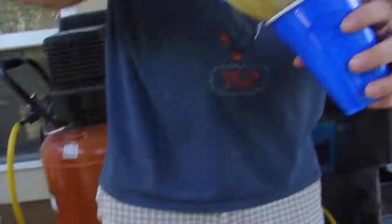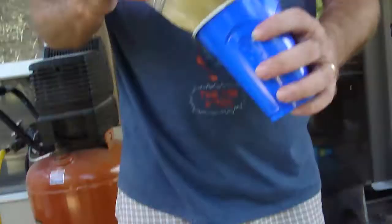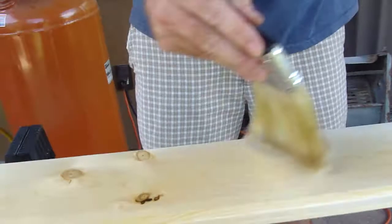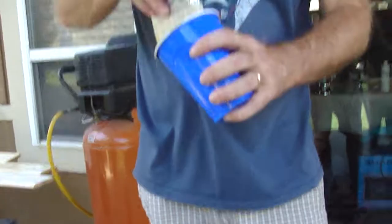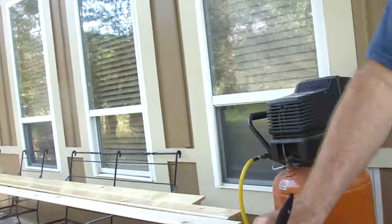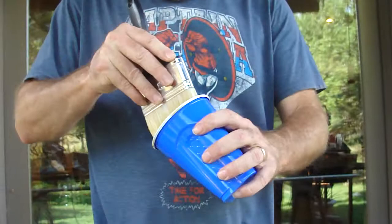This is Ponderosa Pine, the 16-footers. I bought 12-footers and 8s off Craigslist from a guy that had them. These are Interfor Classic Ponderosa Pine Select for the 16-footers I'm using. The other ones I bought just from Home Depot — they're just some sort of white pine. And they seem to look just as good as this Ponderosa Pine. The Ponderosa Pine seems to have a little bit more uniformity, but if you go and dig through the stacks at Home Depot, you can find plenty of beautiful boards that'll match right up. I think if I'd do it all over again, I'd probably just use 12s, 8s, and 4s and use my pattern.